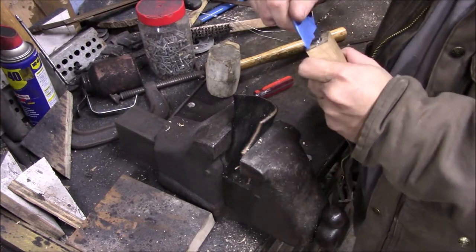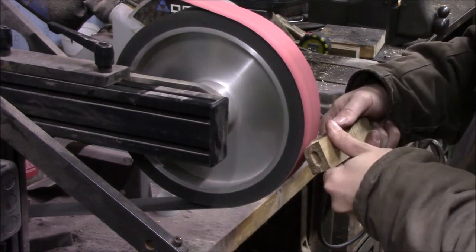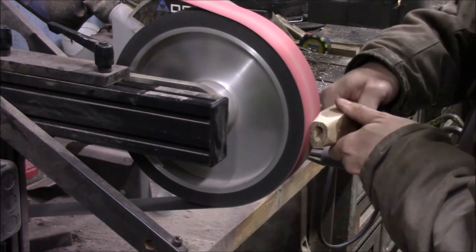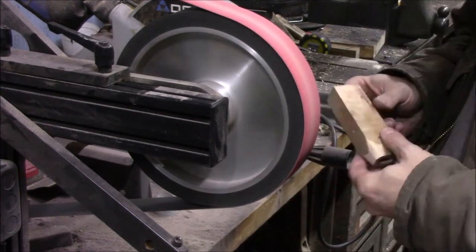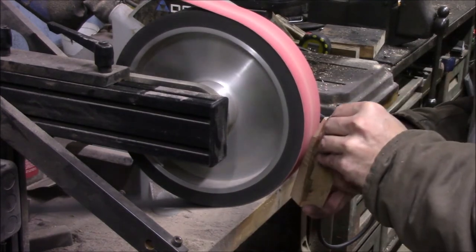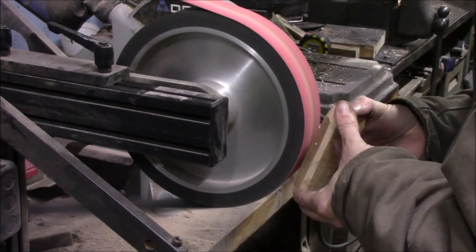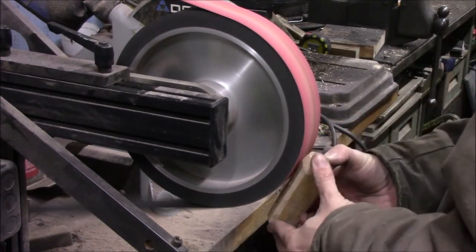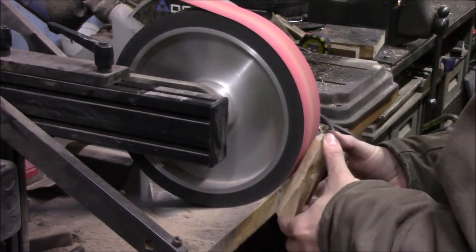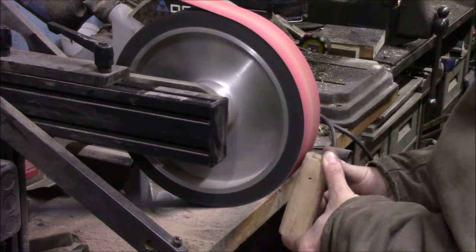I didn't worry too much about getting the perfect fit on this knife as far as my own needs. I just kind of rounded up the end a little into it — I wasn't worried about getting it to where it fit so tight you couldn't see the gap. Shaping a handle is just a lot of grinding away at it. You might save some effort by spending more time at the bandsaw, but I tend to jump to steps that take off less material sooner because I have a tendency to overestimate how much I'm taking off. You can't put it back on, so I try to take a little more time and not ruin the piece entirely.